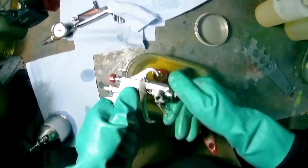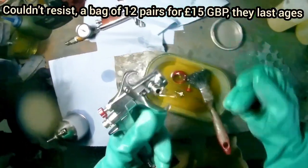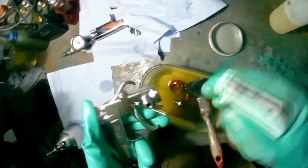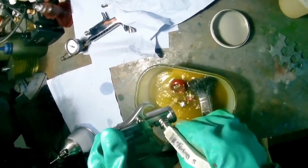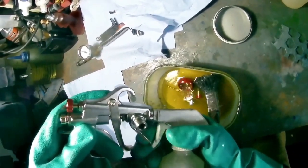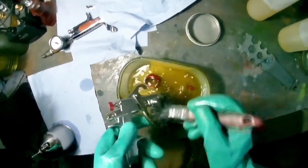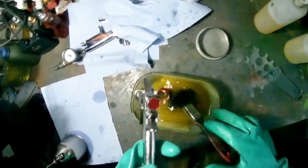Put this in to let the thinners get to work - could do with a smaller pair of gloves actually, these extra extra large are just too big. Now we're going to put the straight thinners through, which will clean the passageway and clean where the tip goes in. Give it 10 or 12 little pumps like that, then keep the gun facing downwards and point it in there to clean inside. Brush over the outside of the gun and then put it on the airline and blow it through.